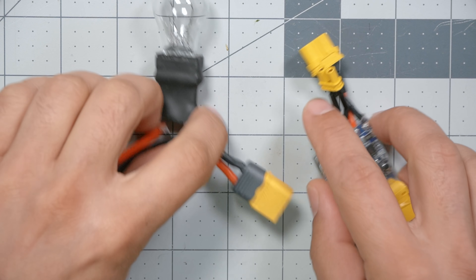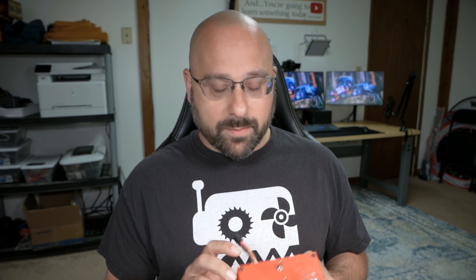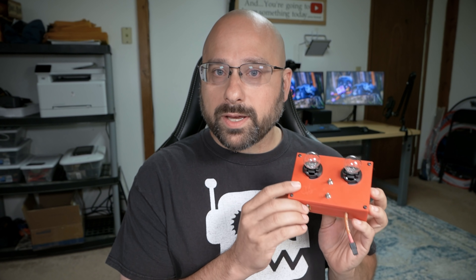The takeaway: smokestoppers aren't perfect, but they can protect you against some fault conditions, and that makes them very much worth having. Just be aware that the smokestopper is telling you that current is flowing, and know how to recognize whether that's a fault condition — like a short circuit or a bad ESC — or just normal current flow. And if you want to build this exact box with the switches and everything, I've got a tutorial including STL files for 3D printing. Link in the video description below, along with a link to the V-Fly Short Saver — I wouldn't be without it. Thanks for watching. Happy flights.